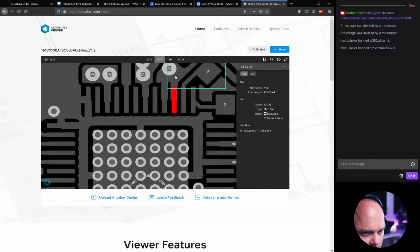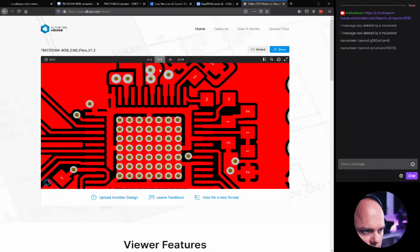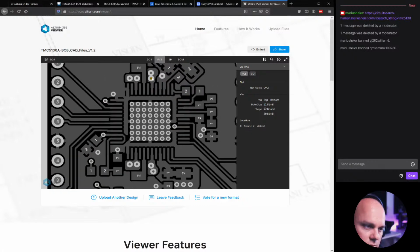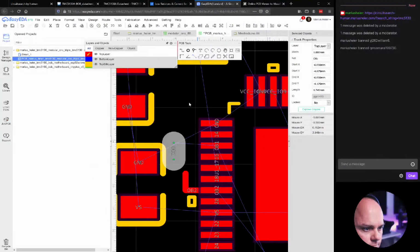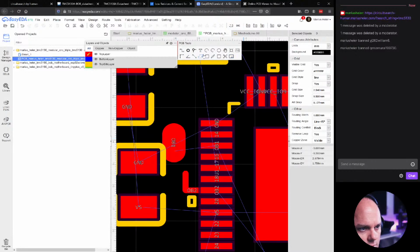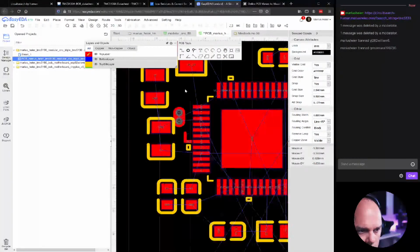Vias. Let's see. Yeah, it's angled 90 degrees. So you see, they kind of do the same. So it goes out to a couple of vias here and just dives down. So we'll do the same thing here. And then we can use the vias like this. Okay. Just leave that for now.